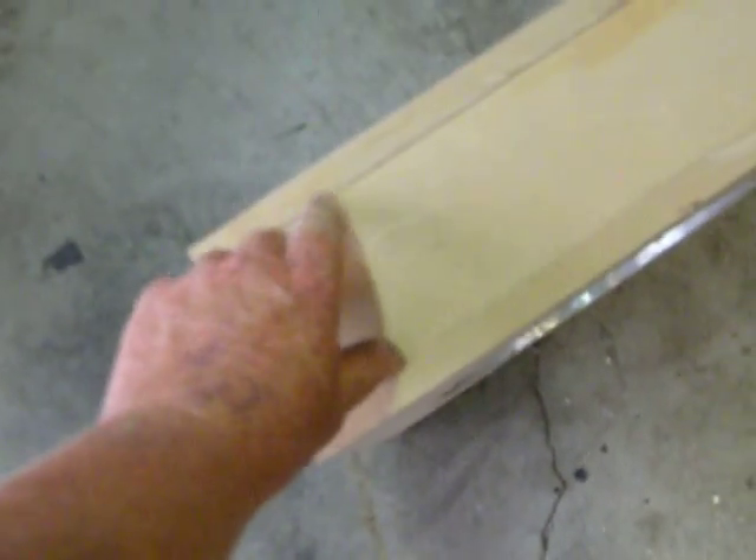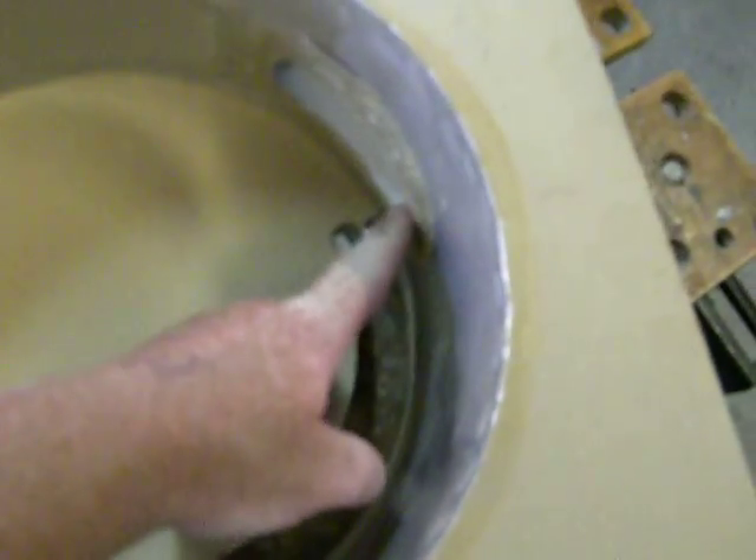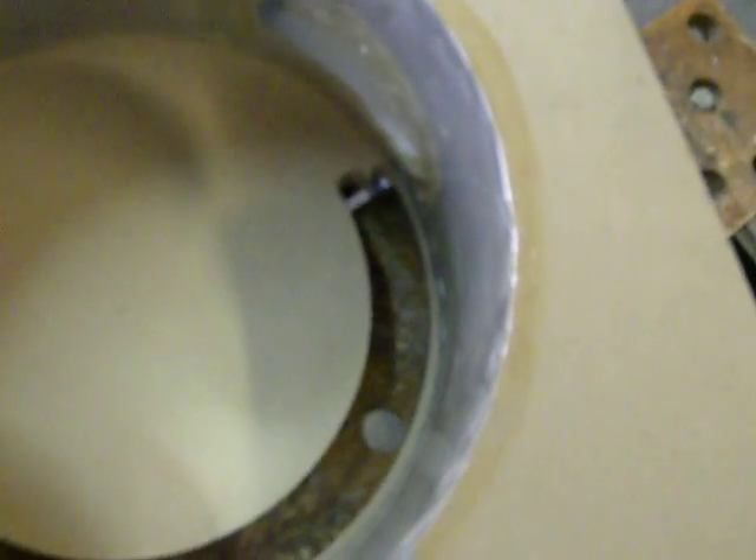These are 3.5 inch right here, which makes it easy. The bottom piece — it's a little over halfway around. You'll set this piece on it like so — basically it sits on it, and you'll just screw it into place when it's all done. So you have your inlet here and it spins around — the dust spins around and then it falls out as it spins.